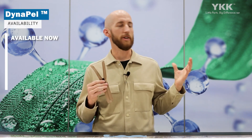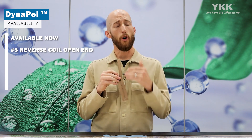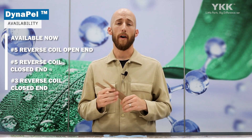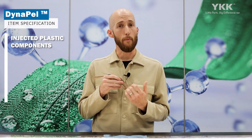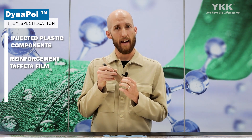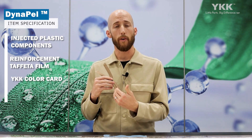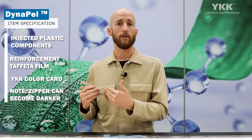Availability-wise, this item is available now. We're launching it at the Outdoor Retailer Show and will also be showing it at ISPO in Germany in a couple of weeks. This is Number 5 open-end, available for open-end left insert for USA markets; we're also developing the right insert for markets outside of the US. We have Number 5 in reverse coil available for closed-end applications, and Number 3 for pockets outside of center front, available closed-end as well. The item uses injected plastic end components for open parts, top stops, and future two-way components. The reinforcement film for open-end products uses what we call a tafta film — a colored nylon film limited to 38 colors, matched to your tape choice. Right now we're following the YKK Global Color Card. Note that zipper color after treatment can become slightly a darker shade, so we recommend sampling to confirm it matches your intended look.